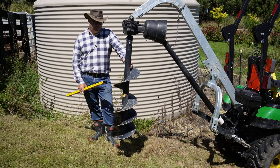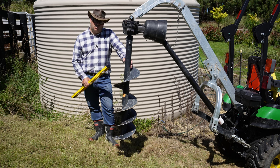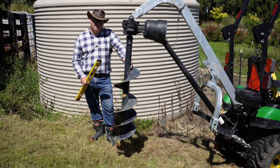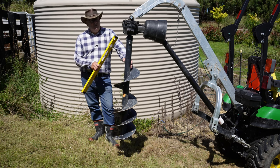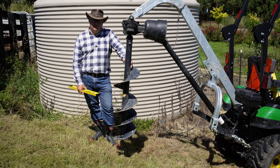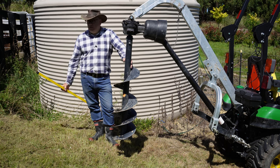One of the key things to be mindful of is the diameter. This is a 300mm wide auger, which is quite a bit larger than the post that's going in — that's only 110mm. What we need to do is to be able to ram the soil around it once it goes in, so the auger has to be quite a bit wider than the post. Also consider the arc of the bar holding the auger from the back of the machine — as we start to drill the hole, it will actually start to come out and then back in. We also need to be mindful of the slope of the ground. If we want this to be vertical, we need to position the machine so that we're dead vertical to the ground.